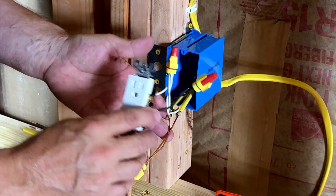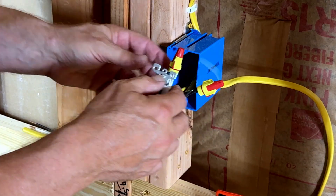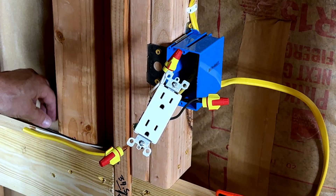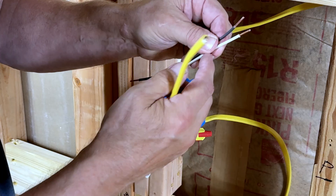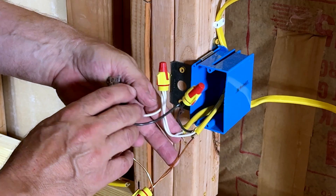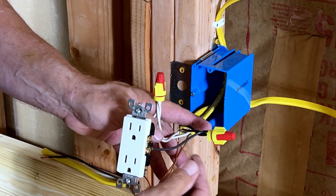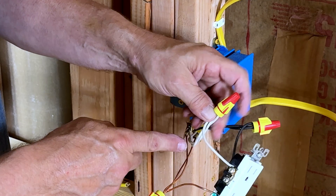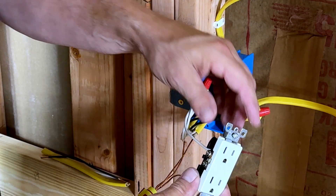This is the second method. If you notice, I now have three wire caps instead of just the one at the earth ground. We're going to do the same thing we did with the earth ground, but also with the hot and the neutral. You're going to take a piece of spare Romex, pull the cables out of the inside, and make your pigtails. You're already pulling one out for the earth ground, so you'll hook all three of them up. I have the wires coming in — hots here, one coming in and one going out to the next one — wire cap that with my pigtail. Then on this side I have my neutral coming in, neutral going out, and a pigtail going into the receptacle.